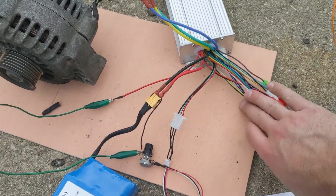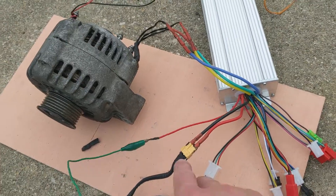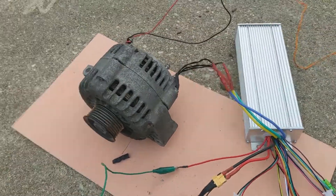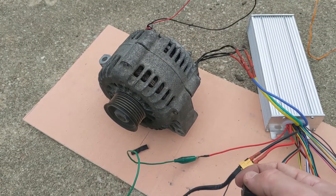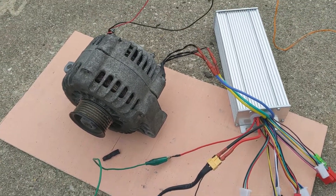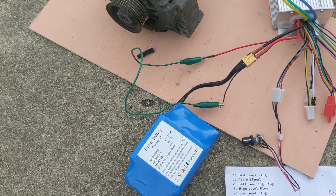So that's how the wiring is done. You can leave all of these wires alone except for the A, B, and C coils, the positives, and that one wire that needs to be positive 36 volts for it to work — the switch plug. You can put a switch there and connect it to the ignition. I hope this video helps somebody with the wiring. I don't know how long this battery will last; I've been playing with it for a little bit. It does have a lot of power, so hopefully soon I will put this on the go-kart. I will need to buy a few more batteries for extra power. Thank you so much — please watch my other video if you haven't seen it already.